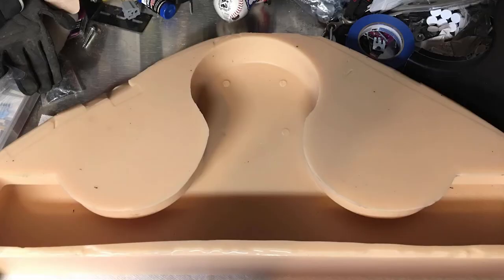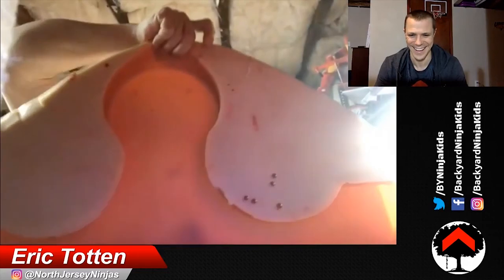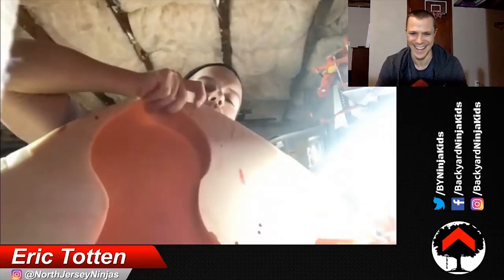The molding process is fairly straightforward. You glue the piece down — you can see a lot of the silicone on the back that didn't peel off. You build a box around it, and you slowly pour a silicone epoxy over it. What you get is something that looks like this — and this will make a perfect replication of a wingnut every time.